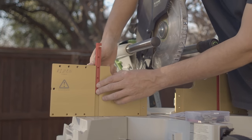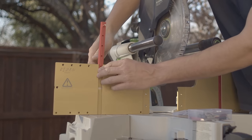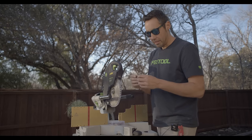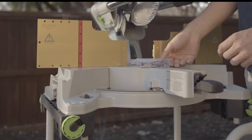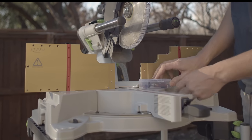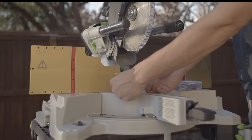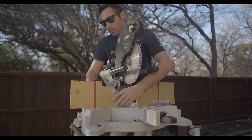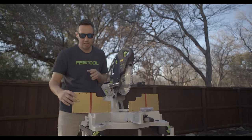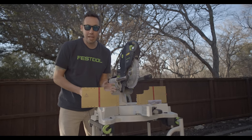If you wanted to set up a crown stop, you throw a shelf pin in one of these holes, tighten your thumb screw and you're set up. You can see if I put it in the top hole and bring my jig up, I'm cutting a massive crown — that's actually impossible because it's above even the rails of this Kapex, but you get the idea. You can put it anywhere — the opportunities are endless. You can also drop a shelf pin in the bottom hole for a micro stop: butt up against that, make a cut, butt up against that, make a cut. It's the first system that allows such micro stops, and you can slide the fence to dial it in exactly where you want.